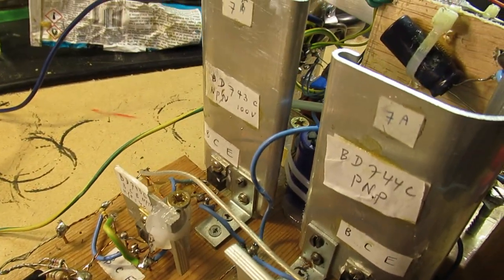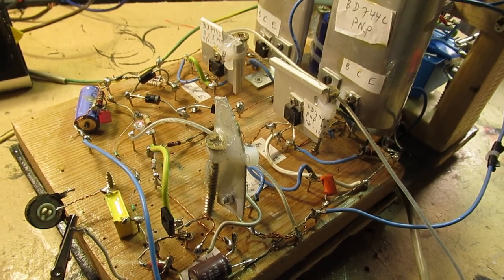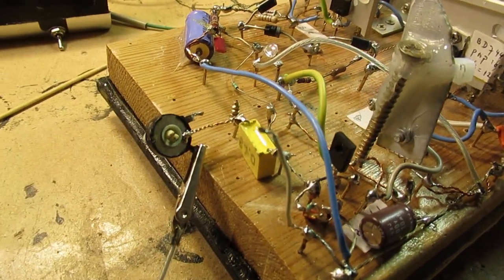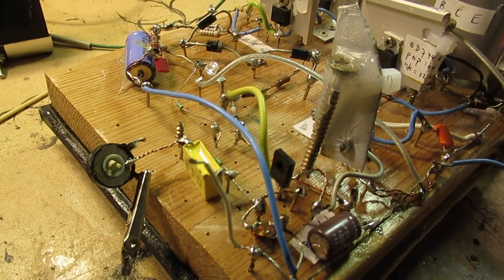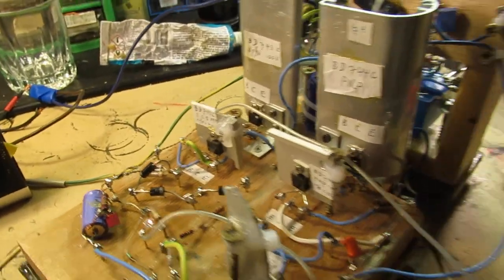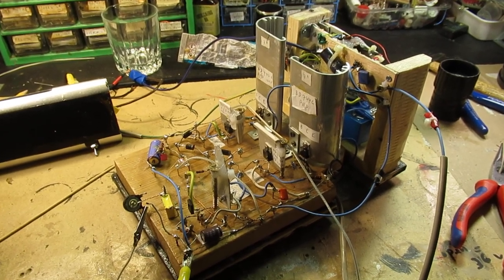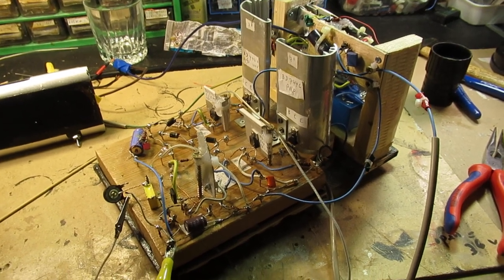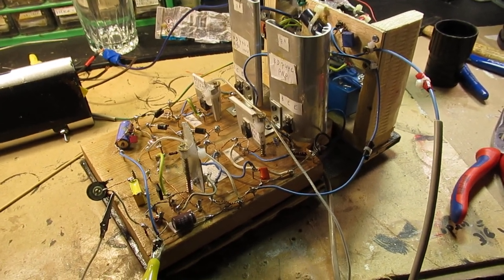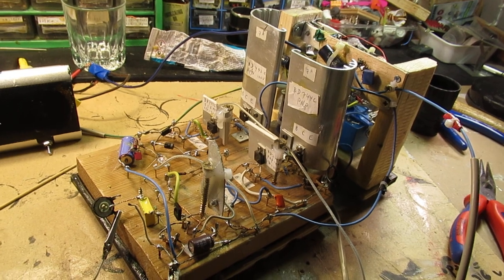Thanks for watching. I only wanted to point out the two types of hum, and then especially hum caused by not proper shielding and a too high sensitivity at the input of the audio amp. That was all. Thanks for watching. It's only a vlog, and in the future I will surely show the complete schematic with the bass boost without all these strange phenomena.